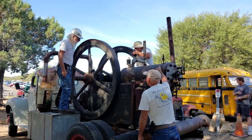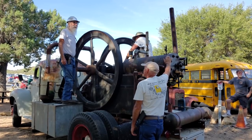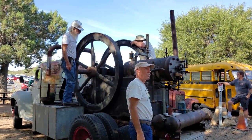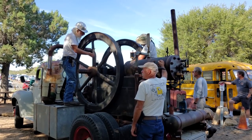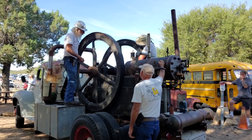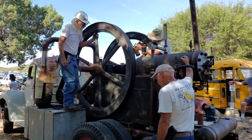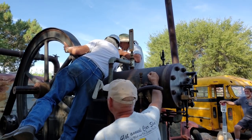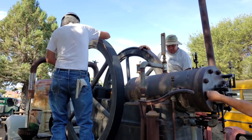At least you don't have to start it like some of the old traction engines, where you used the flywheel as the method of starting. Well, that is a recommended procedure. On the test floor in the plant, they spun the engine, brought it up against compression in normal rotation, then got everything set and primed and spun the flywheels backwards. So it bounced against compression, tripped the ignition, fired, kicked it, and ran forward. That works very well, but with it on the truck you can't make sure everyone is clear and safe — it's just not a safe procedure. We've done it one time just to see if we could. At a museum I'm involved with in California, we have a tractor with basically the same engine, and we start that one that way — spin it backwards.